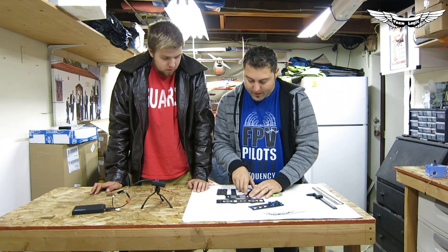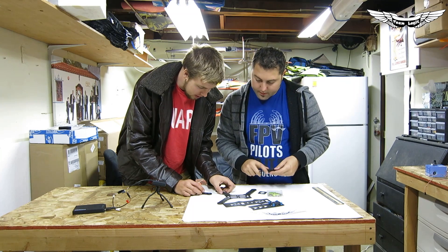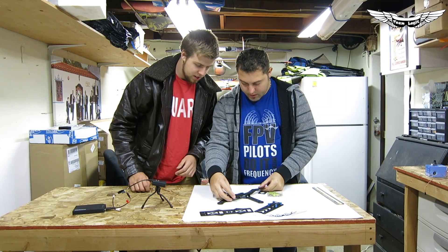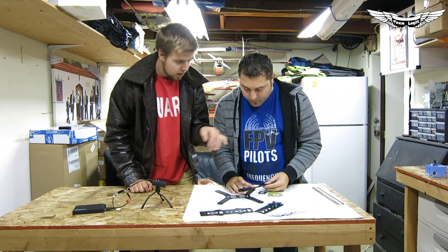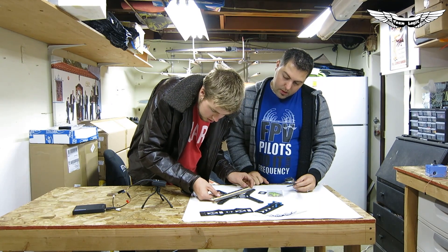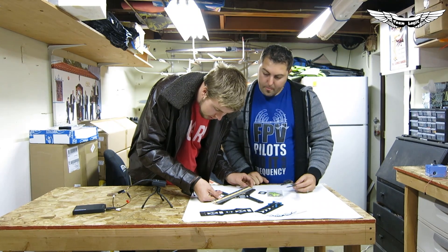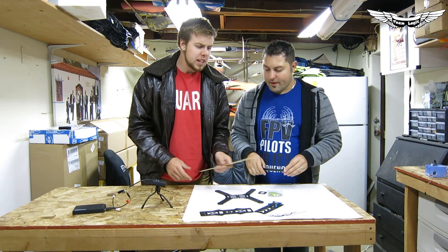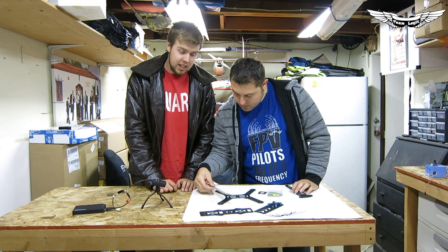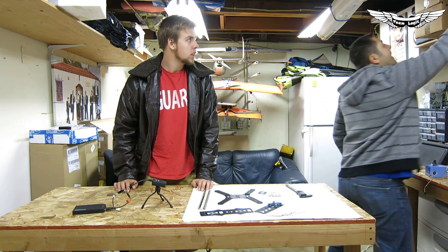Let's mark this up real quick and see what the arm length is. It is 250, or they claim 250, but it's all marginal on how good the construction is on one of these Chinese frames. My micrometer only goes up to 150 millimeters, so we have to go old school. They claim it's 250, but I'm getting a measurement of right about 285 millimeters. About 285 — so that's definitely not a bad thing. I believe these will fit 6-inch props on your mini quads — I did check them out and they will fit the 6-inch props, no problem.